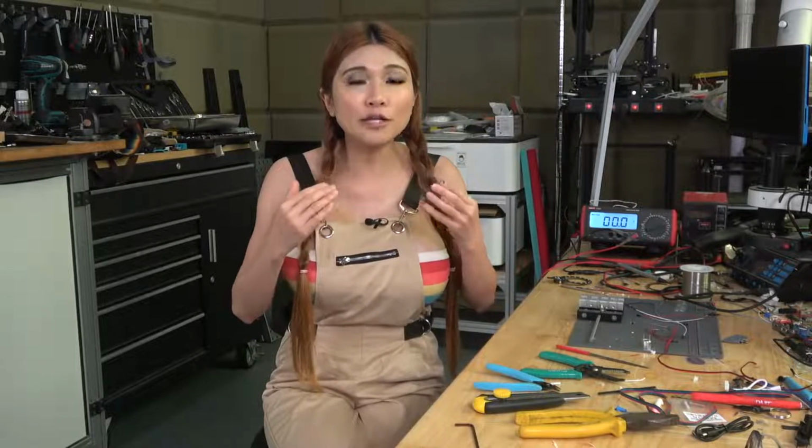The team addressed this problem by building the transducers into a bracelet, so natural speaking gestures would wave the focused ultrasound over a wide area. What I'm going to do is build them into a choker, so wherever my mouth is pointed, the transducers are pointed also, hopefully making sure my speech is always overlapped by the audio of the ultrasonic transducers pointed in the same direction.